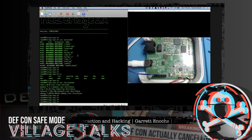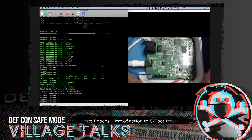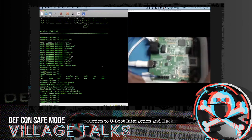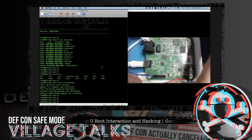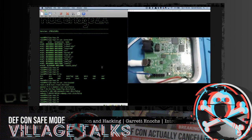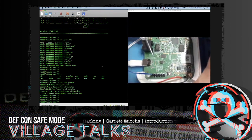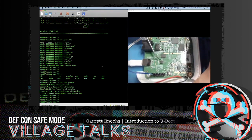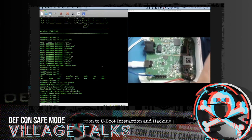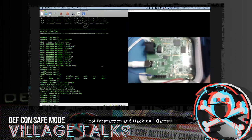Yes, that's a great question. It is a data line, and it's in between these two flash chips on the, I don't know if I can get a better view of this thing, but that's looking terrible. I don't have a magnifier to get you a better view, but basically there is a pin in between the two chips that is sending data. It's basically this pin right here. It's a little silver flat pin there. And if you look close on the motherboard, you can see the tracks going between those chips. You can kind of see it, but now it's all blurry, of course.